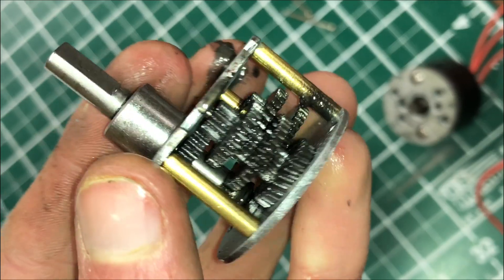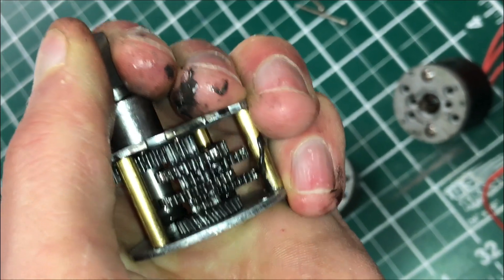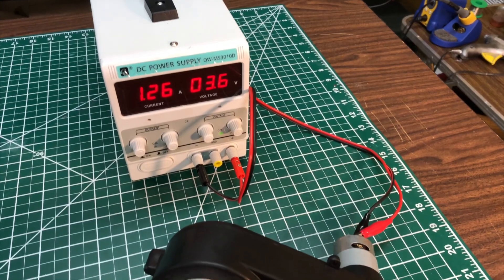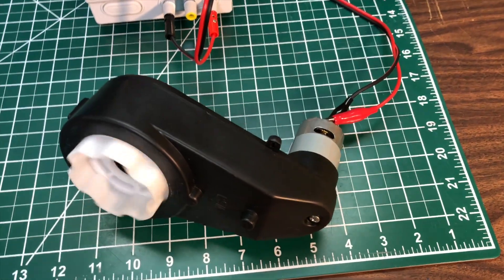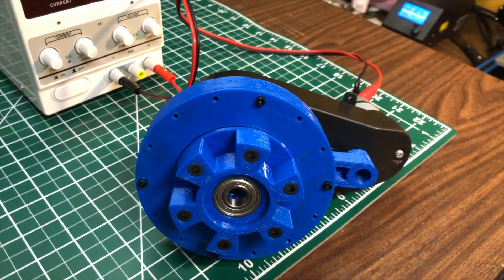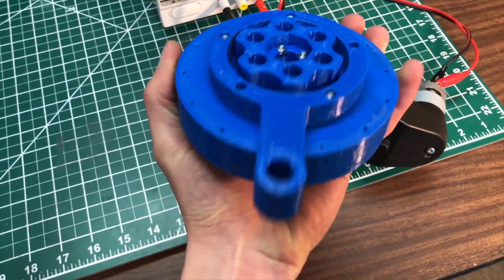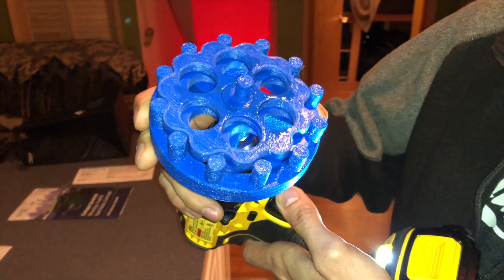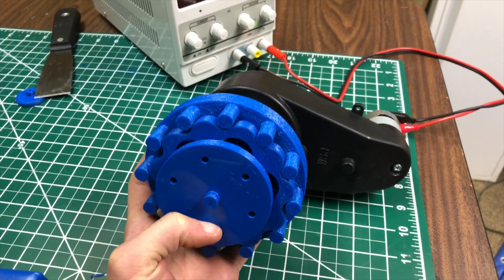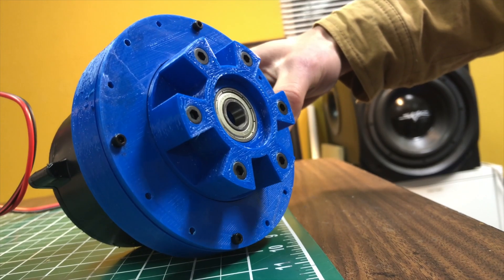Upon inspecting the faulty gear motor, it appeared the gear didn't actually strip but one of the axles that the gears were attached to came out of its mounting hole, causing the gear teeth to separate. I still think I was probably overloading these little gearboxes so upgrading them wouldn't be a bad idea. For the next gear motor design I decided to go with these super cheap Barbie Jeep motors. They spin too fast alone so I designed an additional 3D printed cycloidal gearbox with a 13-to-1 reduction ratio that goes in series with the Barbie Jeep gearbox. I chose the cycloidal gear design simply because it is super cool. In episode 2 of this series I'll be adding the cycloidal drive to the rover and seeing if it works. Thanks for watching, bye.